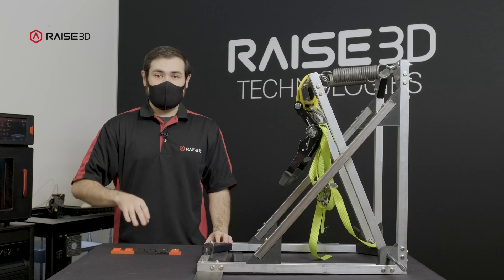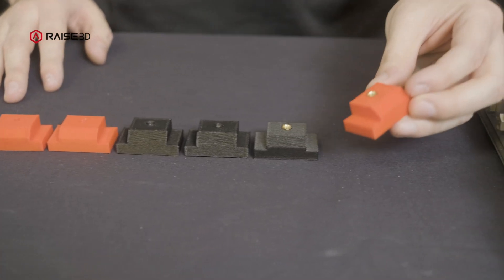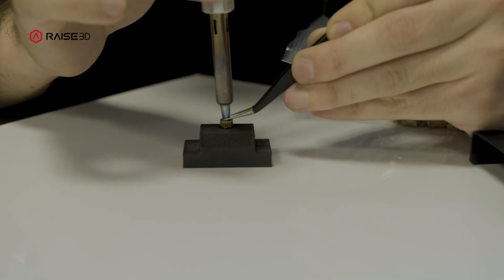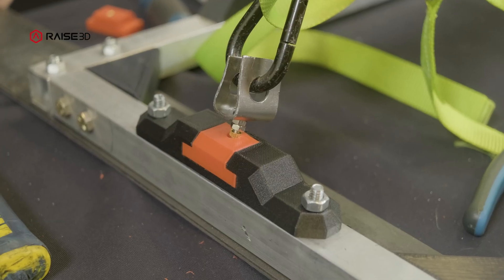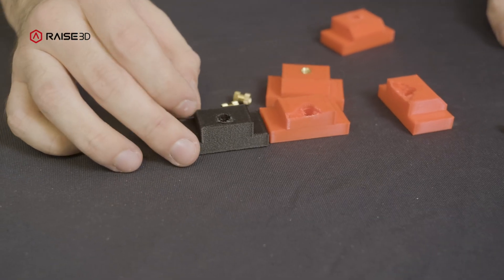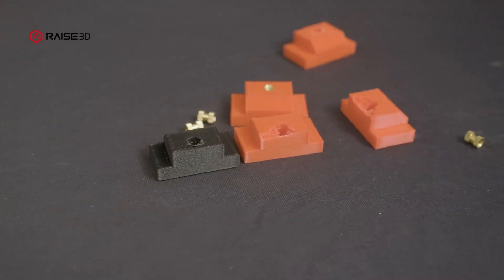With the smaller insert design we've done six different styles of inserts. The first ones are cores printed horizontally with the inserts pressed in from above. When running them in PLA they tend to break away the back area in the direction of the force. The Nylon X ones instead almost slip out of the core rather than breaking like the PLA ones do.